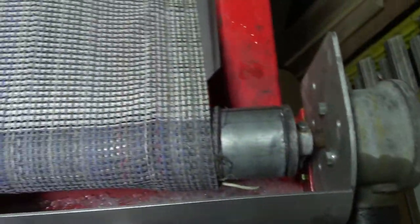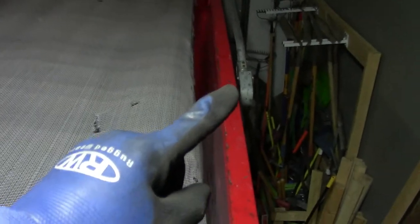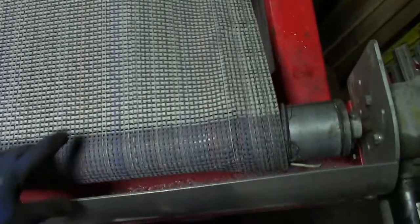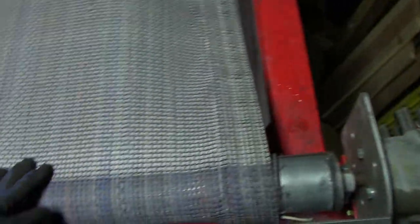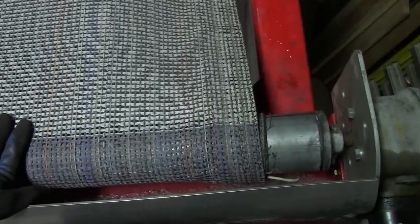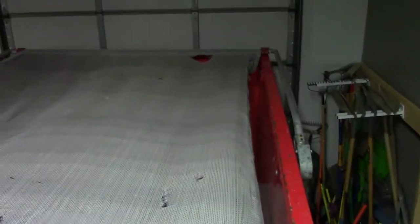Next I'm going to take out these three bolts. Before you do this step, real important — make sure you have your tarp arms all the way extended, because the spring will try to rapidly whip the tarp and roller as soon as you start loosening these bolts. You don't want anything like that to happen where you might get your fingers pinched, so make sure you start with the tarp all the way rolled out.